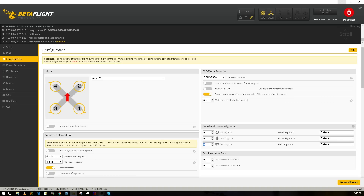If the orientation is not correct, go to Configuration and find the yaw degree alignment. Just keep playing with that until you get it right. For example, if the arrow is pointing to the right, you would set it to 90 degrees. I have a video on motor orientation from a while ago, so I'll leave a link in the description below.